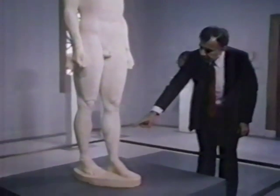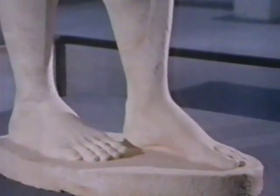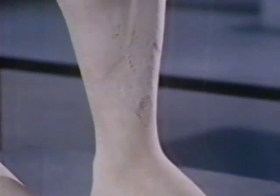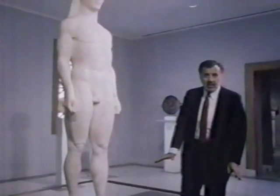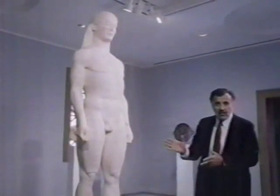When the statue was discovered, it had fractures at the knees and at the ankles. Any earthquake vibration could transfer to the ankles, and because they're very small, that would be the very first place that it would break. From that viewpoint, we had to design a system so that absolutely no vibrations from an earthquake would be transferred to the statue at all.